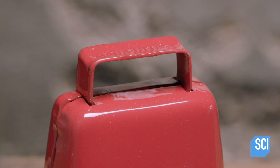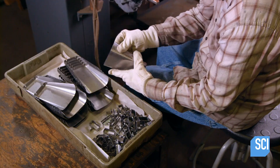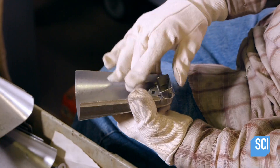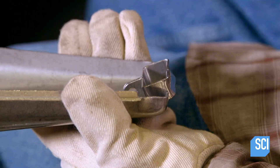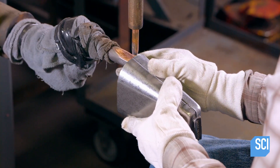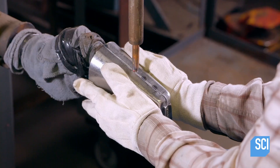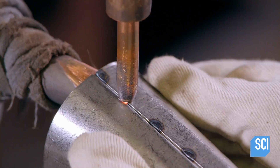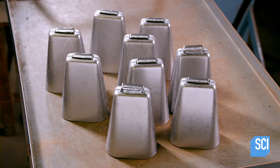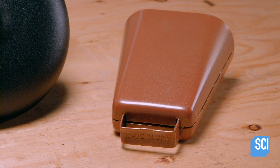The bell's shape and the material it's made from affect the ring's pitch. To make a cowbell, an assembler uses two flared steel components to form a cone. He inserts a handle between the two parts at the top and welds the seams of the bell shell to hold the two parts together, then welds the handle to the cowbell body. The handle contains a small loop that extends inside the bell body to hold the clapper.